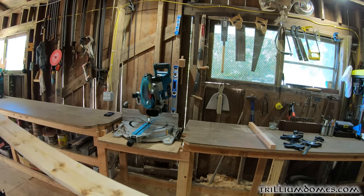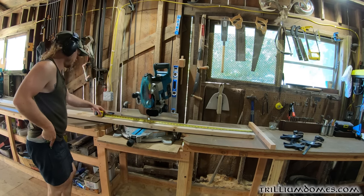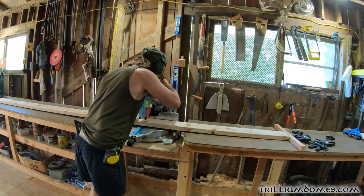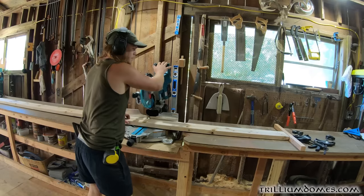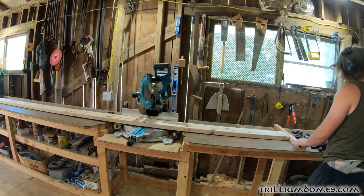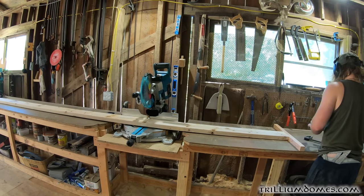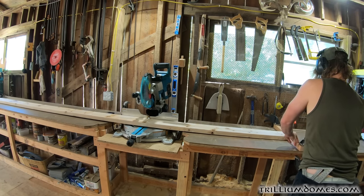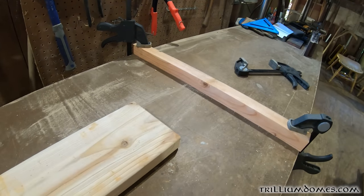So the first thing I do is cut my stock into manageable pieces. Look at the plan and find the longest length of any panel you've got. And generally you can cut all your struts to that length. The shortest strut might be a few inches shorter than that, but that's a negligible amount of waste. For this dome, that length is roughly 4 feet. I'm gonna do a calculation, see how many struts I need, cut everything ahead of time at 4 feet